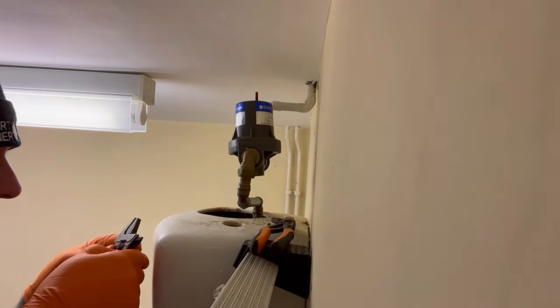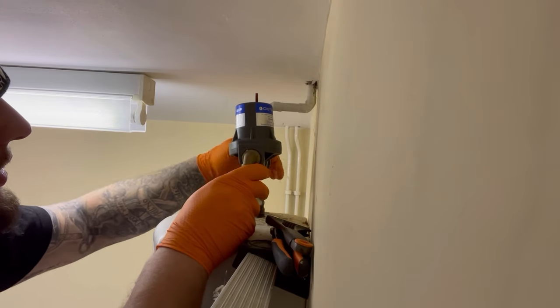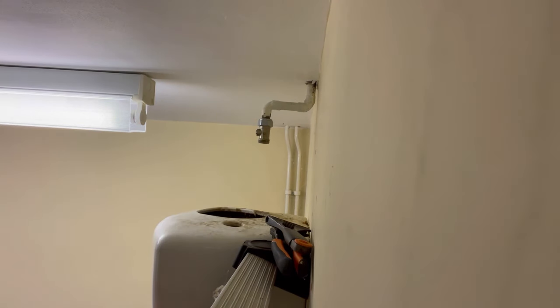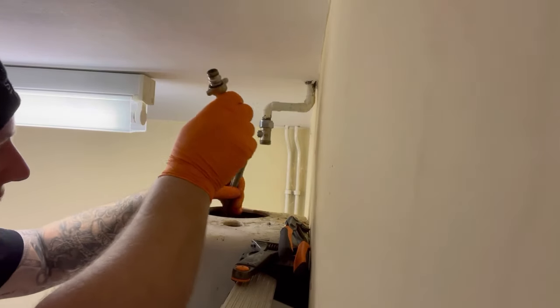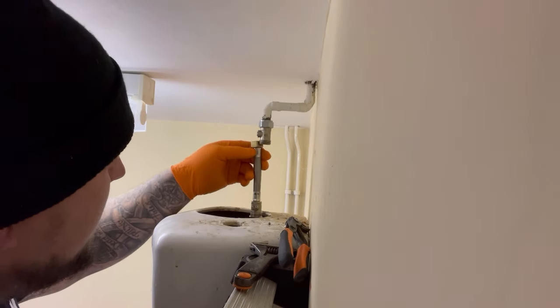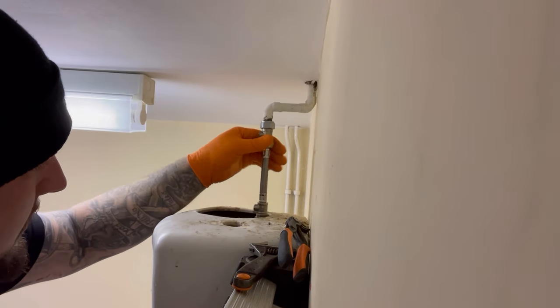Spoiler alert - it's absolutely had it. It's an old-fashioned thing. Now, it causes a hell of a lot of condensation because it is constantly running. The type that you want to put in have got a sensor, so it senses someone walking in the room and fills up then stops - it's not continuously running. The first thing we need to do is make sure we've got water going into this valve, which we have. Because there are multiple functions on and we want this toilet actually flushing, we're just going to put a hose down and leave the ball valve slightly open so it drip feeds and fills. That will fill up to a certain level and then flush itself. It's a temporary measure, but it's necessary to stop these toilets stinking.